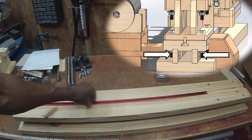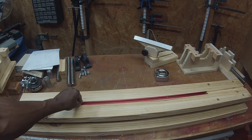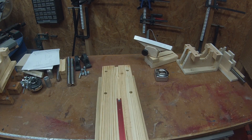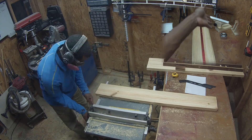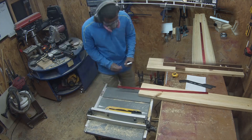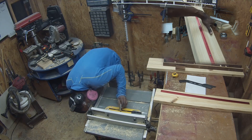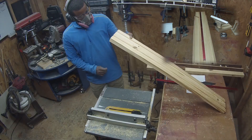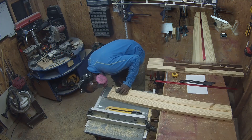While cutting the dados, there are obviously the two sections for the double I-beam base, and then there's also this dado groove down the center. If you're going with the T-track and need this dado in the top, it's really important that this one is centered. What I did to maintain that is I set the blade for as close to center as I could — considering even the width of the blade — and then I ran the rail across the table saw. As I take it off you'll see in the video, I roll it over and run it across the saw again, and once you've done that, both edges of the groove are equidistant from the edges of your board.